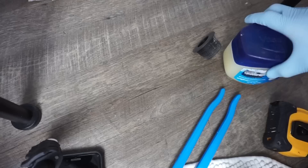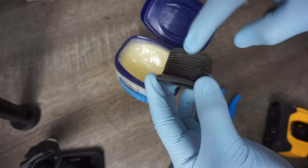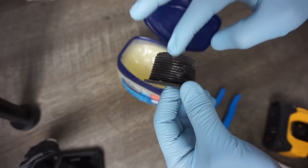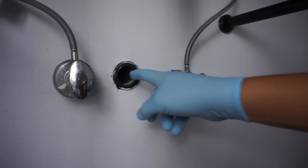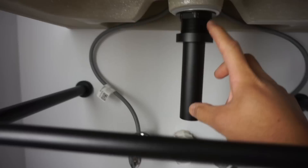Here's a key trick I like to use: petroleum jelly as a lubricant. I apply it onto the rubber plug that came with the kit, and around the insert, so you can easily slide it into the wall drain opening without any struggle. I'll leave the petroleum jelly link in the description below.